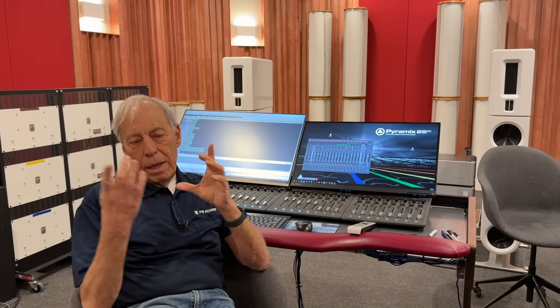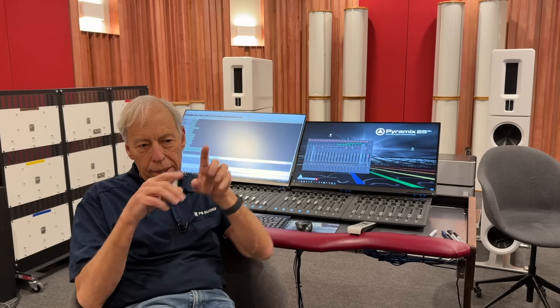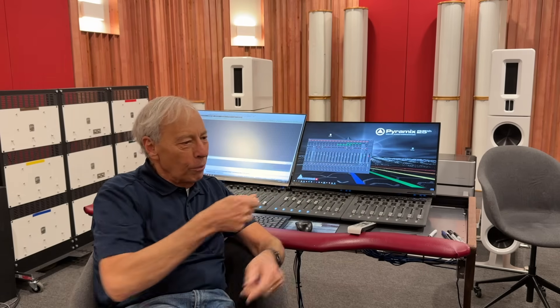It's a great idea. What he's talking about is — we know that this Octave Studios, for example, and pretty much every reasonable studio on the planet, is wired up fully balanced. Everything in here — there's not a single-ended connection anywhere in this studio. And the reason for that, of course, is noise. Because we know that an XLR connection has both plus and minus going at the same time. If that goes into a differential amplifier like he would like to do, then you get the difference between the two signals, which is the signal, and anything in common — the noise — is canceled. And that's how we can have hundreds of feet of cable running all throughout this place, picking up noise, and it's dead quiet. This is one of the quieter studios and systems I'm familiar with in the recording industry, and it's all due to the quality of the electronics and the cabling. But at the end of the day, it's because it's all balanced.